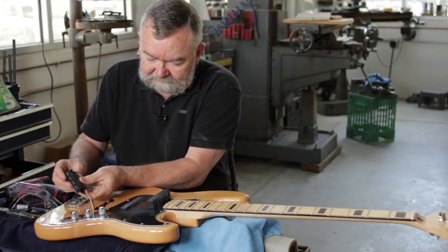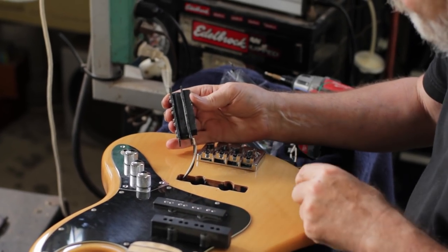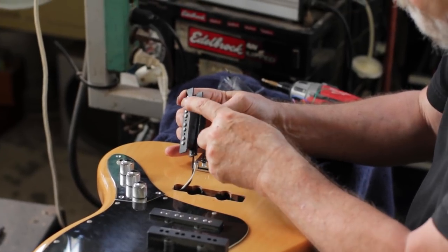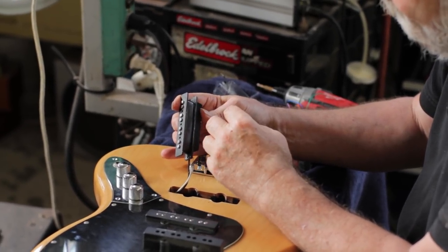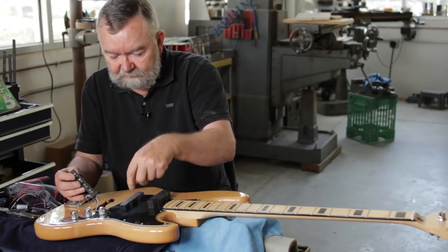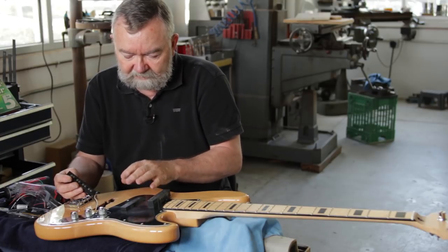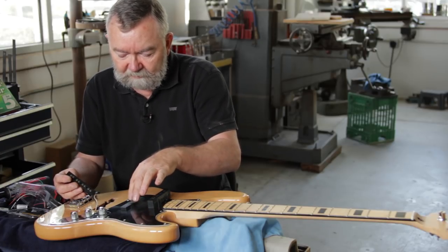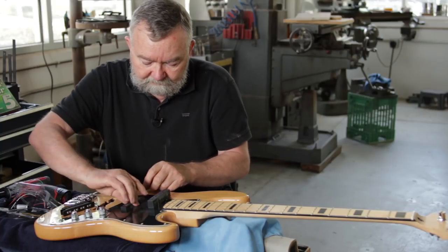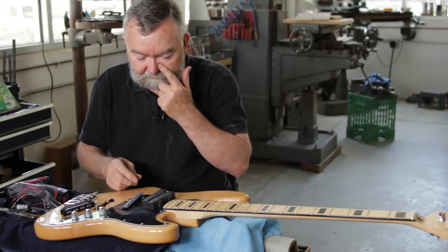So I'm going to take this out, and you can see the difference between this and the old one — this has just got one long coil. Normally when these pickups are made, they wind one in one direction and have the magnets at the opposite polarity of the other one, so whenever noise comes in, if they're both on equally you'll have hum cancelling. But as soon as you adjust so you only have one pickup or an uneven mix of the two, you'll get hum. With the new ones, they're hum-cancelling all the time, so you don't have to worry about that.